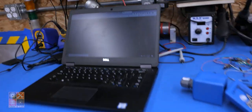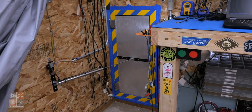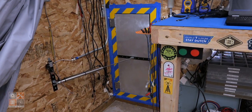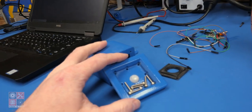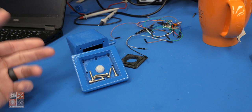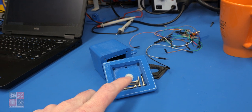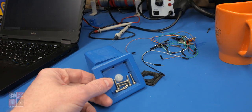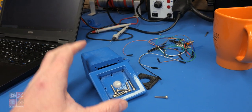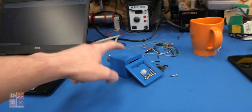So overall, I think that with the break beam sensors, especially the one in the door jamb, that increases the safety of it to ensure that nothing is going to get caught in the door as it's closing. Keep in mind also that I've got the outside motion sensor. This is primarily there just to let me know if something is outside that wants to be let in, but this also will prevent the door from closing if it detects motion. I'm hoping I don't have similar issues with this one as I did with the other one. Don't think I will. It obviously isn't in the path of the door, or it won't be. So that's one of the last things I have to do, is mount that.